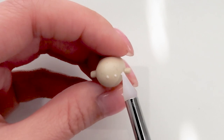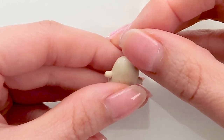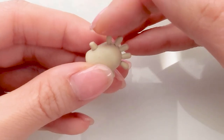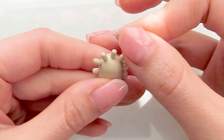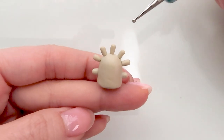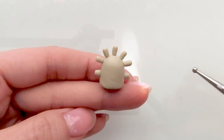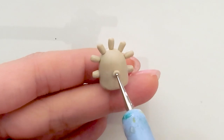There are a few things you have to keep in mind while making your model. One is that pieces that stick out aggressively might cause more difficulty when casting the resin due to trapped air bubbles. This squeakoid has like seven major things sticking out of its body, so I will be suffering later. Also, you have to think about the function of your model — like if this was going to be a charm, would it be better to make a hole straight down, or would it be better if I just pierced it on the hair? But if you go for the piercing method, I recommend you drill a hole after the resin casting, because donut-like shapes would just get stuck into the mold.